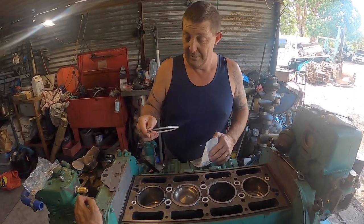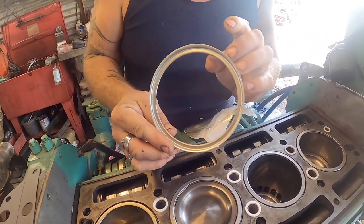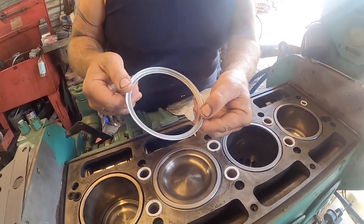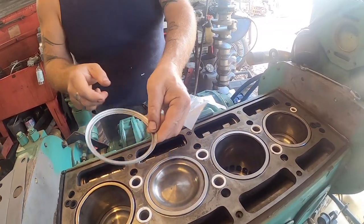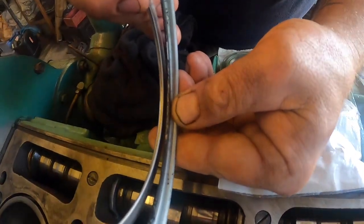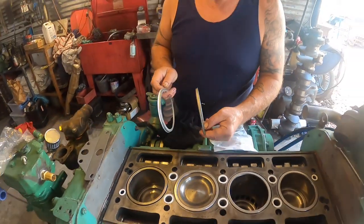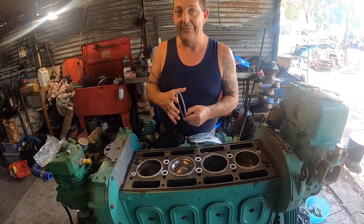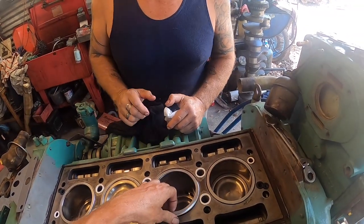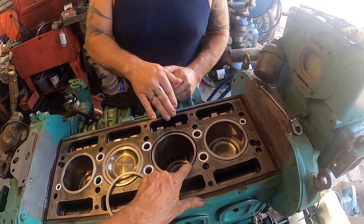That's a compression seal. That's what seals the compression between the top of the liner and the head. Like I said the other day, you can't see it now, but they are folded sections inside that panel. But if you can actually see, that's quite fat. I think one of the older ones is here, so you can actually see how much it's compressed once the head's torqued up and squashed, how much it does actually bring it down. Push it down, yeah. And you were saying before it's shimmed. Crush. Yes, so it's shimmed under the liner, if you need to, to get the 45 thou drop there. Okay.